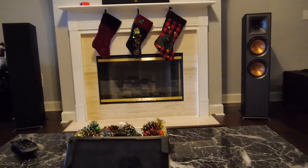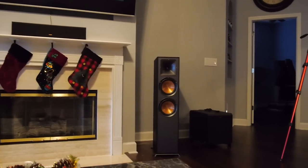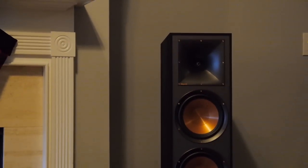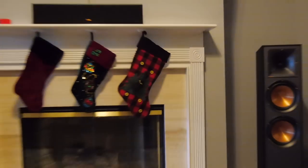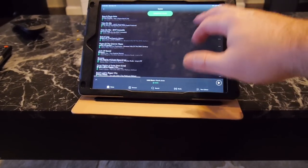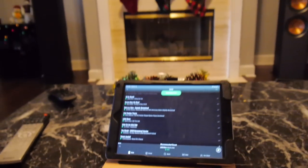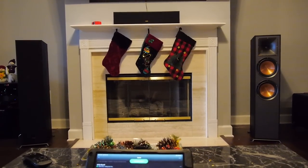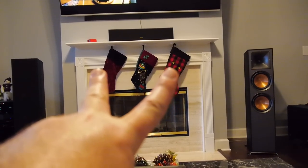I wasn't exactly right from last time, but I wasn't done. Here's what you do when you think you have it right: look at the speakers from your listening position, make sure you're exactly centered on the couch, and check that you see the same amount of side of the speaker from each side — that's a real good indication of symmetry. Now we play the Norah Jones track again. That made all the difference in the world — that tiny toe-in change made her voice go from as wide as all three cushions to sounding like she's actually sitting just behind my fireplace.